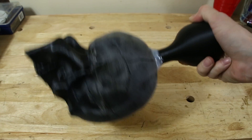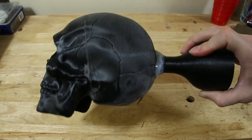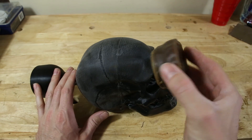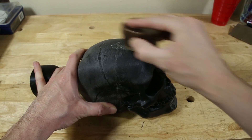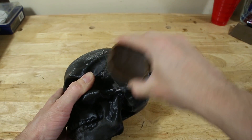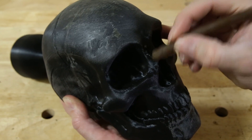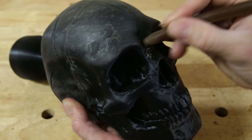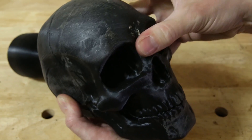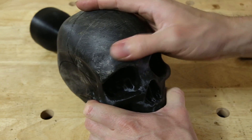I used hot glue to attach the sprue, which is what the metal will be poured into. This glue joint had to be extremely strong because the skull was going to get really heavy. I wanted to try and hide the layer lines from the printing process, so I coated the skull with microcrystalline wax. It's tricky to apply an even layer of wax on a model like this, but with a little persistence I was able to do a pretty good job.